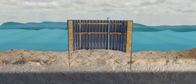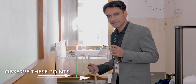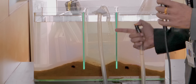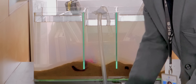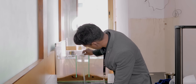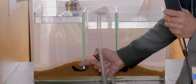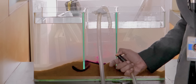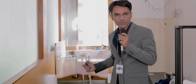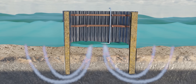Here I have made a small cofferdam to demonstrate what happens when water is removed. The water particles travel in a u-shape below the cofferdam because of the water pressure differential. The same thing will happen inside our actual cofferdam when water is removed — water seepage occurs below the sheet piles. Since techniques to prevent this seepage are difficult to accomplish, we pump the seepage water out continuously.